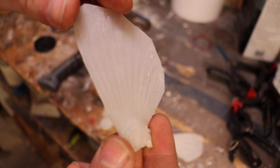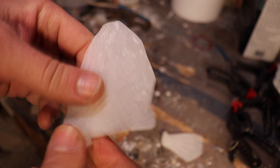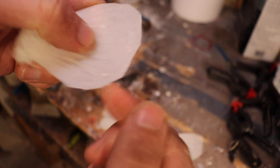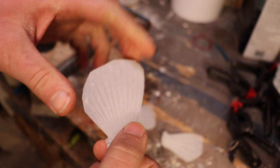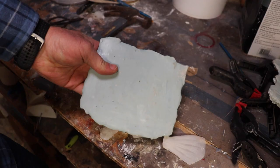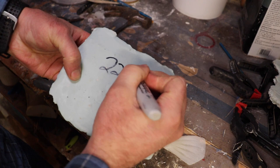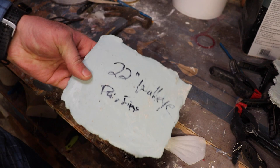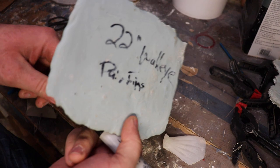And there's our fins — we've got them cut out and cast. You can kind of see the details on them pretty good, and you can see a little bit of translucency in it. I still got to put the details in the end — I'll take a cutting disc on a Dremel and just nick this to give you the individual rays, and I'll trim it up a little bit. But these are pretty much basically how we cast our fins. The nice part is you don't have to worry about any shrinkage — they're the size that you want. What I'll do with my mold is just write what it is — I'll put '22 inch walleye pair of fins.' If I ever get another walleye that's in that 22-inch size, I already have the fins cast and we can just roll with that.